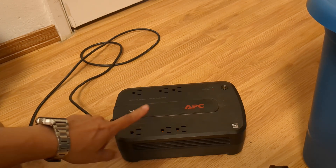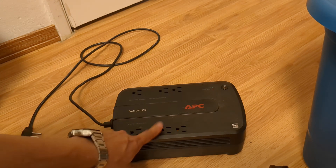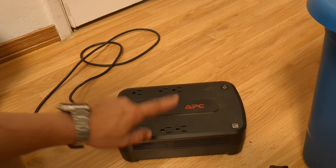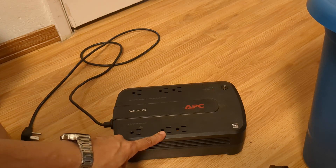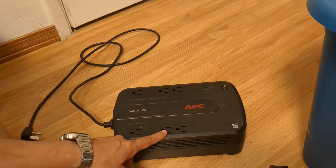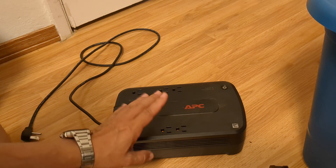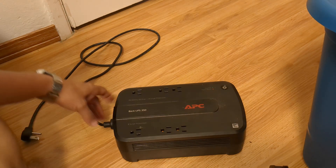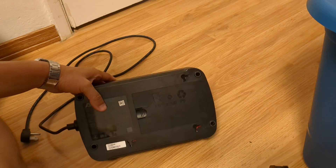These are very convenient if you have a 12-volt battery sitting around. For instance, we're playing with solar, so we have a bunch of 12-volt lithium iron phosphate batteries. If you hook it up to the battery intake, you'll in essence have a surge-protected, low-power inverter for free pretty much. There are a lot of times we would just throw these things away — so don't throw them away.